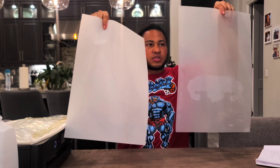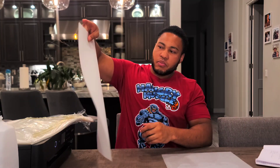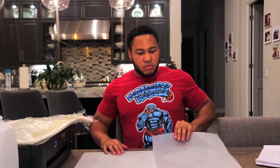The next thing you're going to get is some DTF film. I have two here — one has a glossy side, and then this one is a double-sided matte. Double-sided matte doesn't mean you can print on both sides; there's only one printable side. Most films labeled 'double' just means both sides have a matte coating on them and they look the same, but only one side is printable. To tell which side is printable, the easiest way is to scratch it — if you get some powder residue on your finger, that's the printable side.